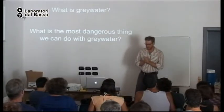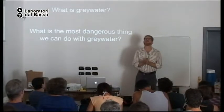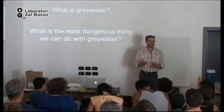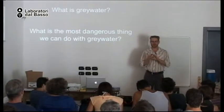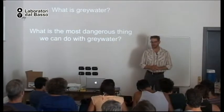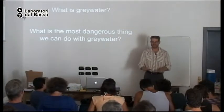One thing in the conventional building codes is they unfortunately make the discharge of gray water more dangerous. Because many of the building codes say you must treat gray water like black water. And so you must put the gray water into a tank, like a septic tank, before it goes to the landscape and the soil. So that practice is turning gray water into black water, and I hate it.